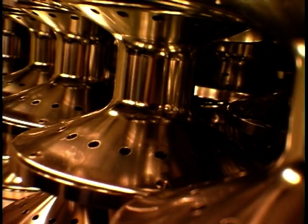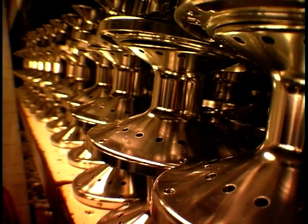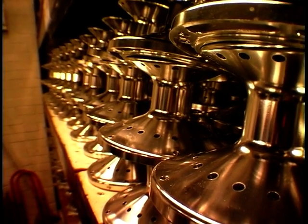Now, the dimples, I know the punching is peculiar to that particular wheel, isn't it? Is that right, to get the spoke angle? That's right. But what about the dimpling? Does that tend to be pretty standard? Have you got more tolerance in the dimple? The dimpling's pretty standard. Yeah. There are some strange configurations where there's a 2x2 or 3x1 dimple. But by and large, the standard one left, one right is a standard dimple. And then it just depends on how big the hub is and the dimensions of the rim to get the angles right for punching the holes through. That's right. Yeah.